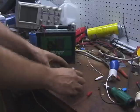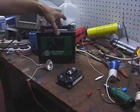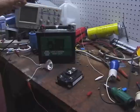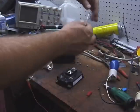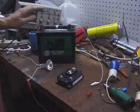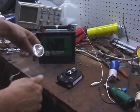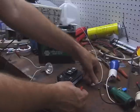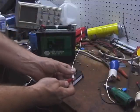To actually test one of these units, I have here a 12-volt battery. This is the negative wire — it should be black but I've got a white one here — and it connects directly to the negative terminal on the battery. The positive is going through a load here, which is a 12-volt light. When I touch the two wires together, as you can see, the light turns on.